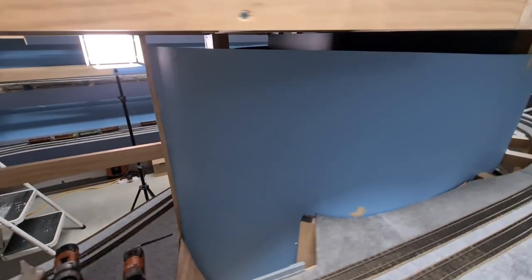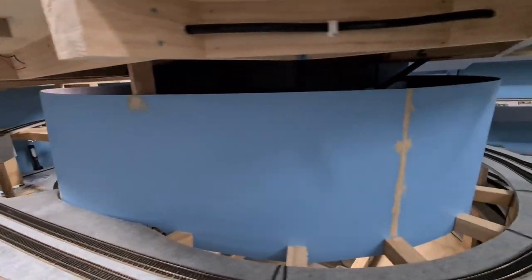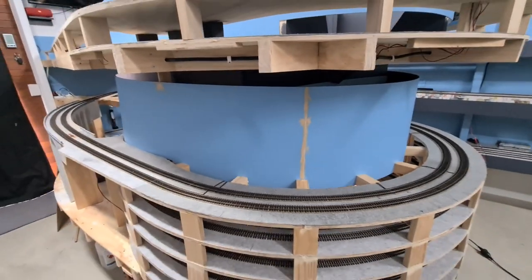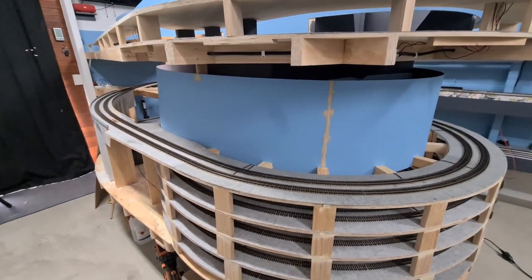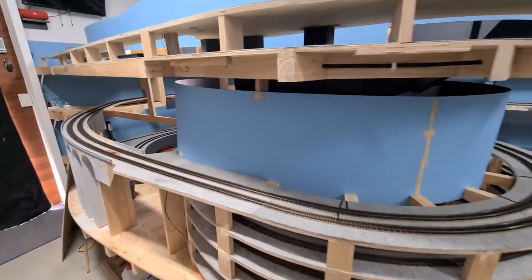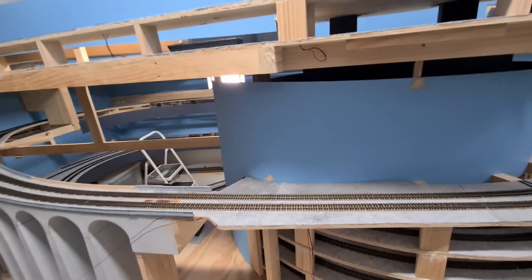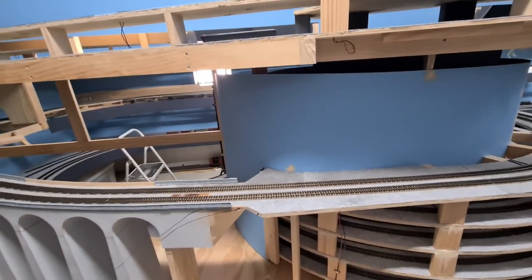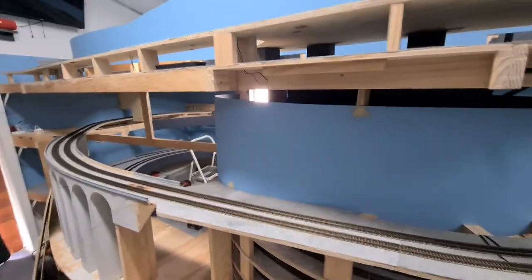Obviously the top still had an angle to meet this side of the board. Once I got that big sheet outside, I took the thin sheet with all the measurements, put it on top, and I used that as a bit of a template to help me draw out the shape. I'd much rather cut less than more. It's just easier to trim if you don't cut enough as opposed to the other way around. Anyway, I'll take you around